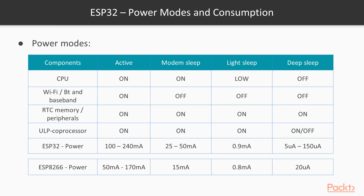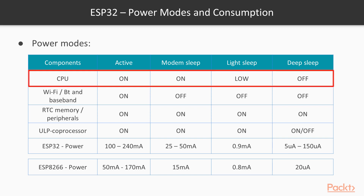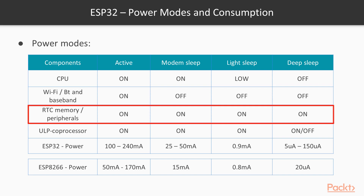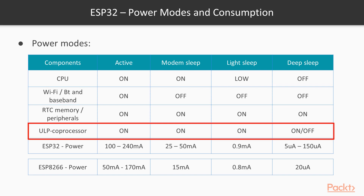The power consumption of both of these modules varies greatly depending on the different operation modes. The availability of different power modes helps us save power when we don't need all of the resources. We have 4 major power-hungry components in this chip: the CPU, which is the heart of the board; Wi-Fi and Bluetooth, where the core connectivity functionality is handled; real-time clock and all the memory peripherals; and the ultra low power co-processor. This ULP processor allows us to do ADC conversions, computations, and level threshold operations while still keeping the board in deep sleep mode.